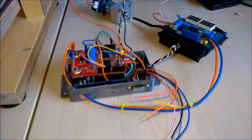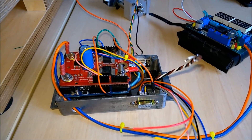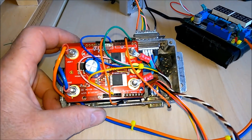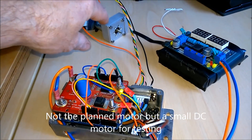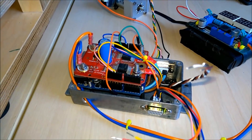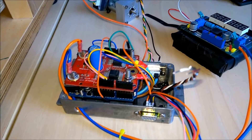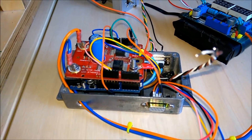So this is the motor controller that I've been building. I built it quite a while ago, tested it, and there's a YouTube video about it already. This time I've just put it into a box and created a couple of connectors for it. You've got the connector to the motor - I've used a standard D-sub socket but commoned up three of the pins to give me the power. And then there'll be a bit of an IO connector there which will go to the gear change system. So I'm just redoing this ready to go into the car - with that case on it's fine.